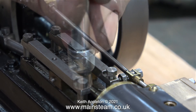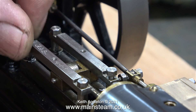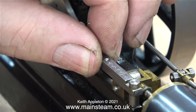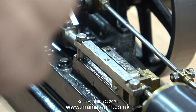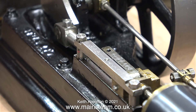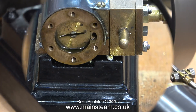The spacers between the crosshead guides and the bed are too small, and underneath every one of the spacers is a small washer — I showed this in a previous episode. It's only any good as a temporary measure. No sooner had I removed the crosshead guides, I put one back in without the washers and it was slightly tight. Once I tightened the 7BA bolts that hold the crosshead guides to the bed, it became very tight. I'll leave that job for the moment and move on to removing the piston.